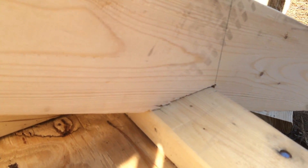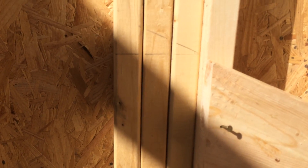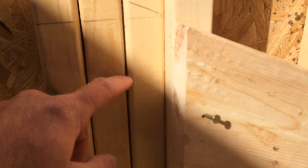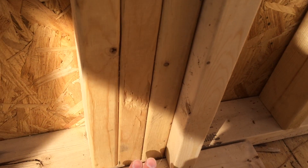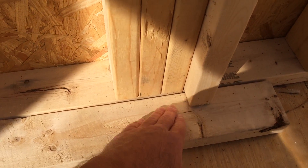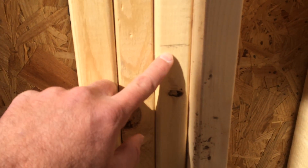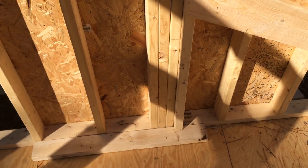Once I have that I cut it out. Another one set up over here just for demonstration purposes — as you can see it's a really good bird's mouth cut. I come over here, make a horizontal line, and because I'm using 2x12s for my beam boards I measure down and make another line. Then I measure from the top of this 2x4 to that line, and that's gonna give me my 2x12 beam board.